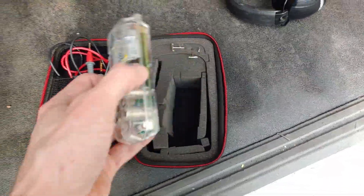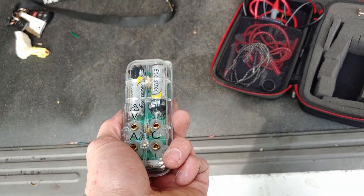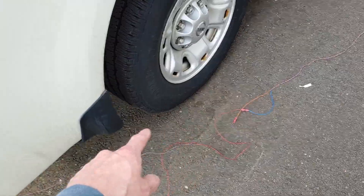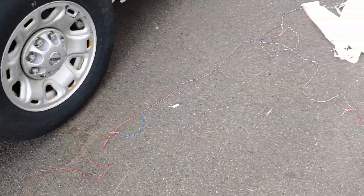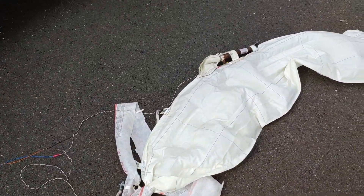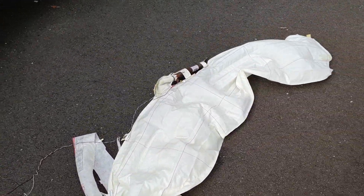My theory with this meter is that resistance mode outputs about one to two volts. Mind you, we've got this long cable with all these bad connections there, there, and there - and this whole thing is a high resistance path to one or two volts. So that's my only theory: there wasn't enough voltage to push through it.